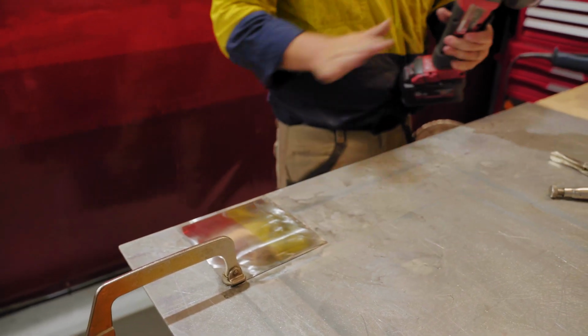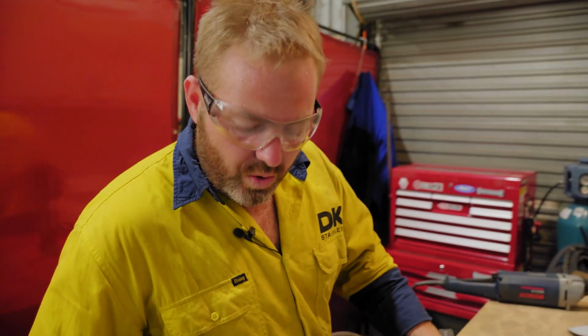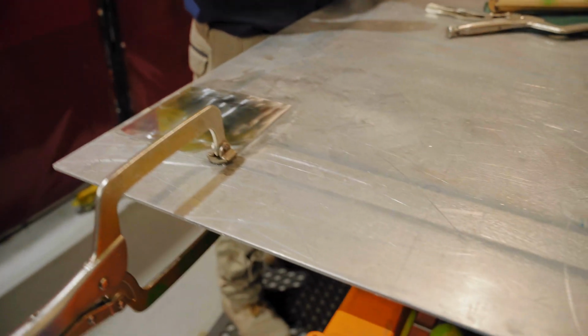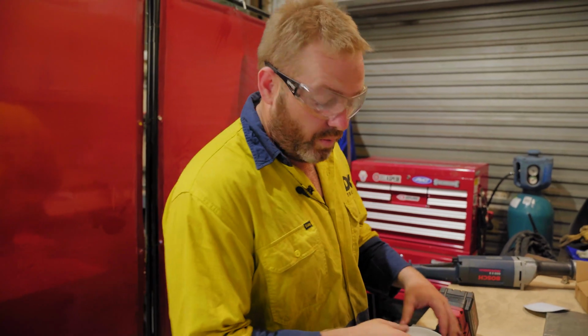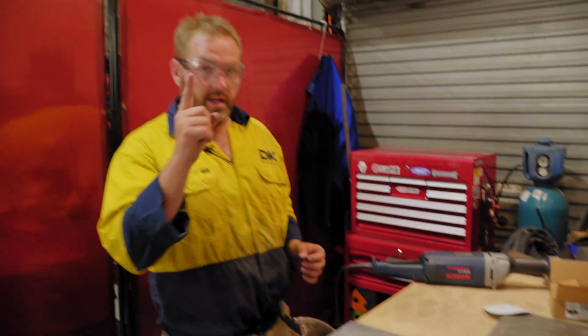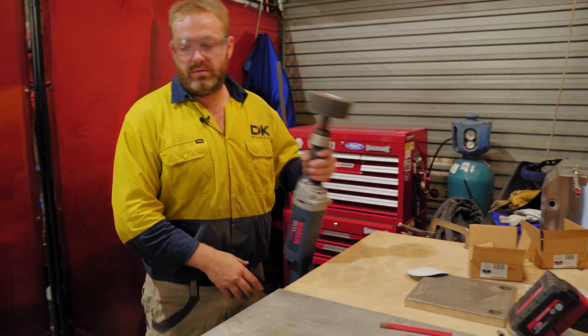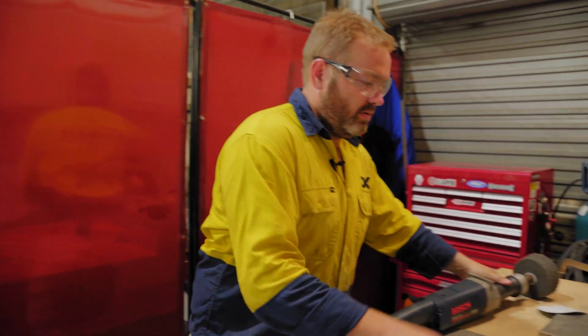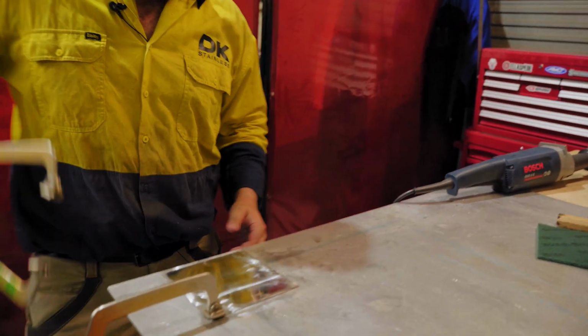I can actually feel where I put that water, it will actually slightly raise that stainless. So it just goes to show, even because you had differential temperature there, the stainless actually warped up. So don't get stainless hot. All right, just like last time.